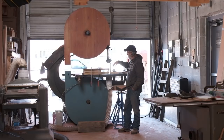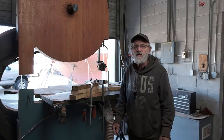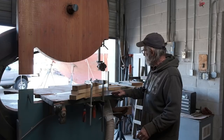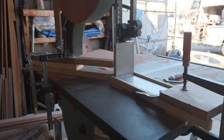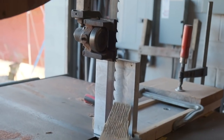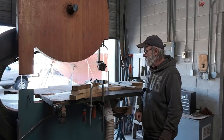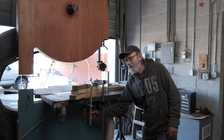I'm going to show you a few more things about it as we get a chance, but first we're just going to get started doing a little resawing. I've got some featherboards on the table here clamped down. I've got a little spacer under the bottom featherboard so it's laying right on the table. These things are just made of some two-by-fours that have got a bunch of bandsaw cuts in them. The idea is to put a little pressure on the piece that I'm resawing, and these things handle it really well. You don't need any special equipment — just a couple pieces of wood and a couple of clamps.